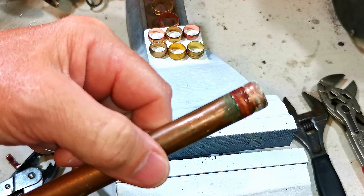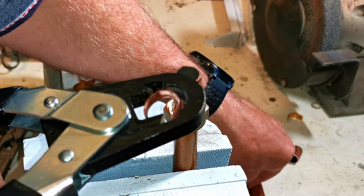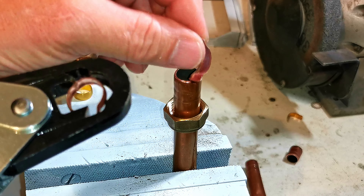As these cutters are brand new, I'll put some oil on them to make sure they're fully lubricated - everything in my toolbox gets wet, so I recommend doing that. It'll keep them nicely lubricated, extend the life, and stop them from going rusty and seizing up. To show you one more copper olive - I barely have to squeeze the handle at all and it cuts straight through nice and easy. I'd really recommend having a pair of these if you're removing a lot of olives. A quick point: when you cut through an olive and it splits in two, be careful you don't drop half of it straight down the pipe - it fits in there perfectly and you don't want bits of olive inside the pipe.